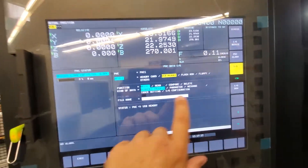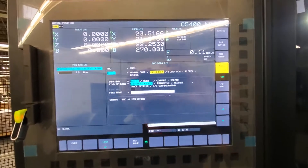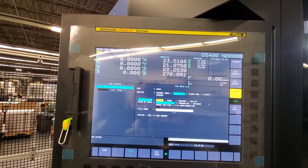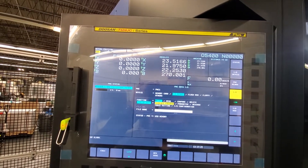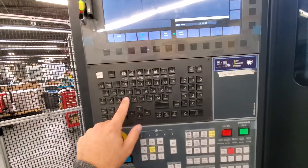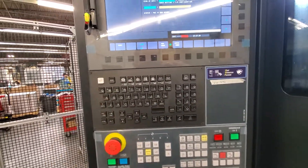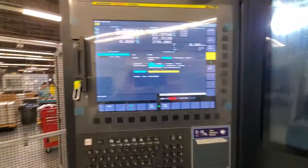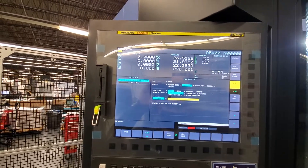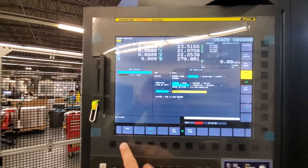You can write parameter, message, trace settings, and I/O configuration — you can do all that stuff. Then you need to give it a name, which I usually end up screwing up. But let's name it HC-400A. I'm just making a backup before I make some PMC edits on this mill. I input that there, it populates, and then you hit execute.